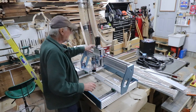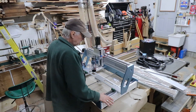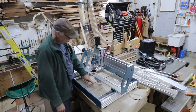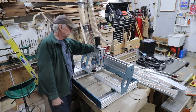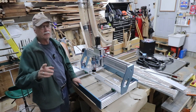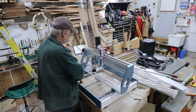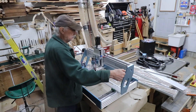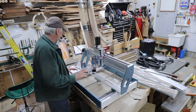The gantry, minus the motor and the spindle, came pre-assembled. The base, all the bearing surfaces, guides and everything, came assembled, except I had to put in a lead screw before I put on the Y stepping motor. I will fall on my sword and confess that I actually put this on backwards the first time around. So I had to pick it up, take it off at the bottom, loosen everything up, put it all the way around, and put it on the right way around by myself, and it's heavy.